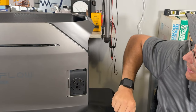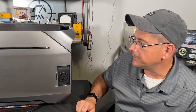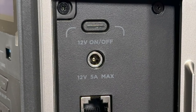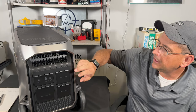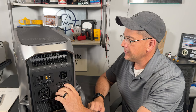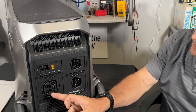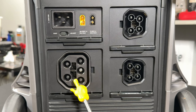On the side they kept the RV plug — a traditional 30-amp plug at 120 volts — and improved the UPS backup to as little as 10 milliseconds switchover speed. On the front side panel there's a DC 5521 plug, a communication/remote cable port, and a 12-volt 30-amp Anderson plug. On the back, panels flip down and push in for easy access. There's the ability to hook two expansion batteries, a main power output port for the Smart Home Panel 2 or a generator plug adapter, an EV charging adapter, plus high and low voltage solar inputs: yellow at 30–150V/15A and black at 11–60V/20A. The rear also has a traditional 120-volt wall outlet input with selectable fast and slow charging via the app.